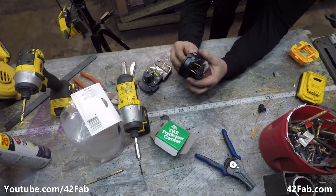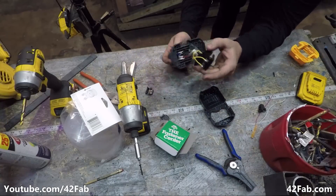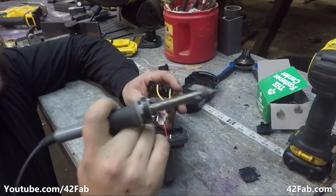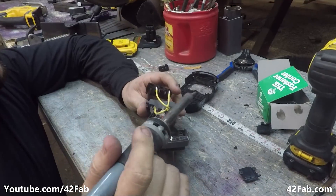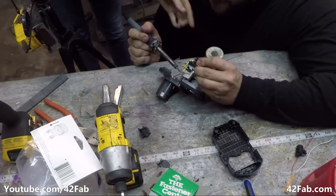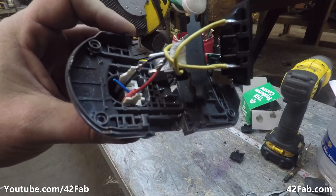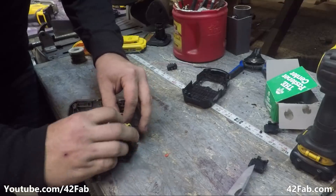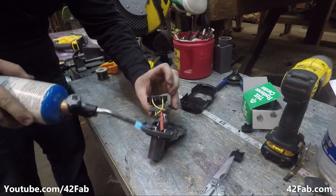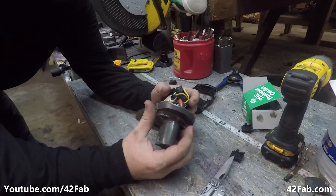Now that this can be fed through that hole, we're going to solder the pieces together on this side — just black to black, red to red. Get some heat shrink for protection there. Have your helper come in with the third hand and feed the solder onto the joint. Okay, well that looks kind of like crap but it will get the job done. Put the heat shrink on there and shrink it with a couple of light passes of a torch. It isn't pretty but it isn't going anywhere either, so that'll do the trick.